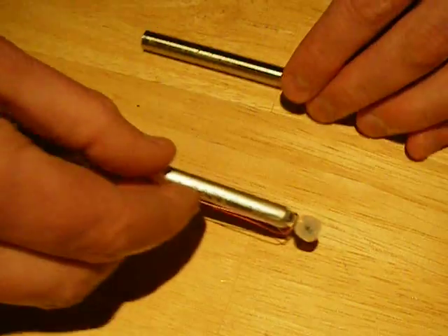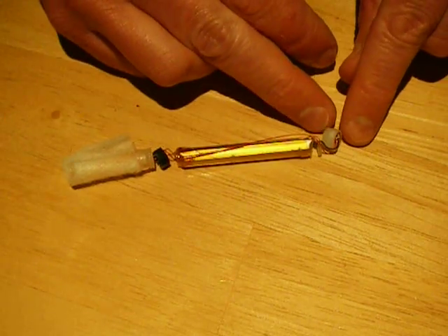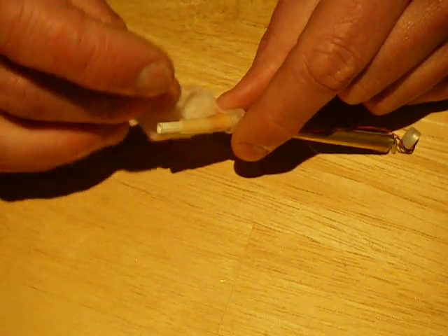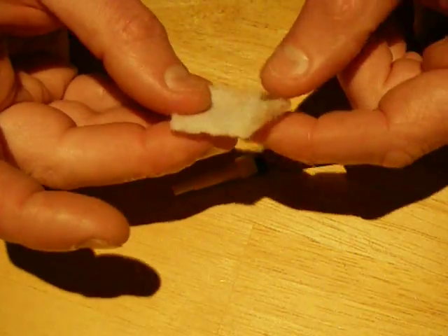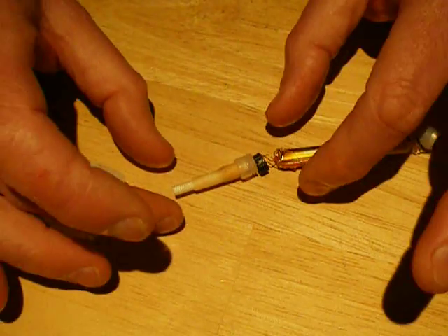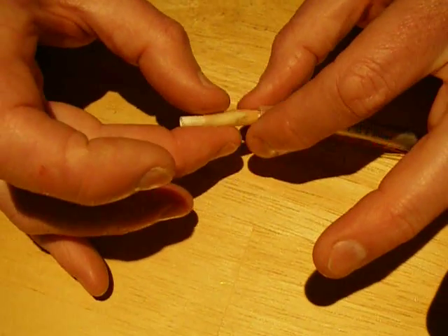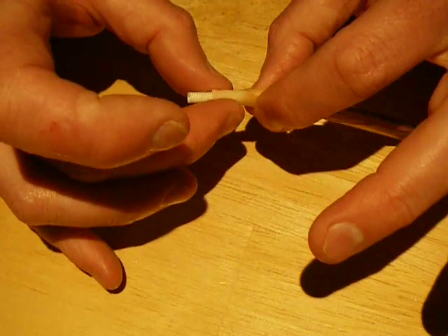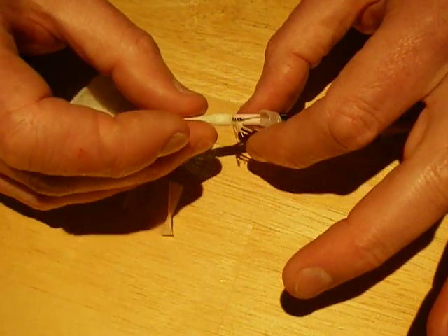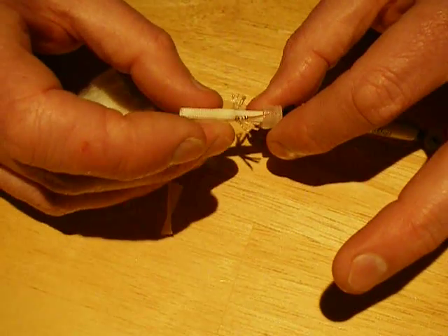Inside, as you'd expect, most of the space is taken up by a lithium battery, a little tiny electronic module at the tip, and then the vaporiser at the end, which is a piece of absorbent fabric - I'm not 100% sure what that is, polyester fabric, not really sure. Fibre glass sort of sleeving, an outer sort of - oh it's tape, let's take the tape off. And then a little heating element and wick, a fibre glass wick that is just threaded through the middle of this.